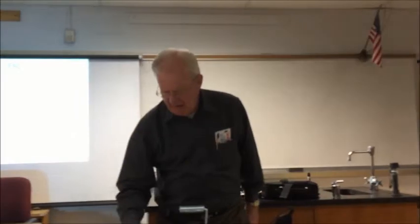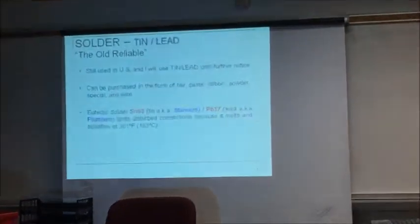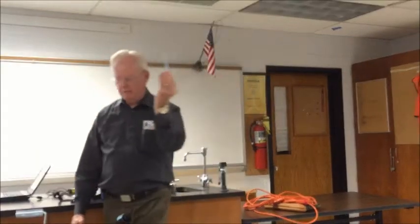Guys, my mainstay of solder is the eutectic that I buy from our friends at Kester. Kester's still the number one solder brand as far as I'm concerned. It is 63% tin, which the Latin word is stannum, and 37% lead, which the Latin name is plumbum. Melts at 361. When I was a kid, when you guys were kids, we used 60-40. Remember that? Then they found out that 63-37 was eutectic. Does anybody know what that means? Yep. It means there's never plastic. It's either solid or liquid. There's nothing in between. So that's why you want to not look for 60-40. You want to look for 63-37.